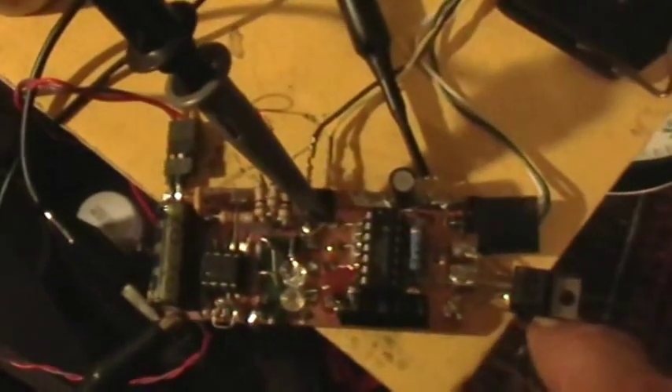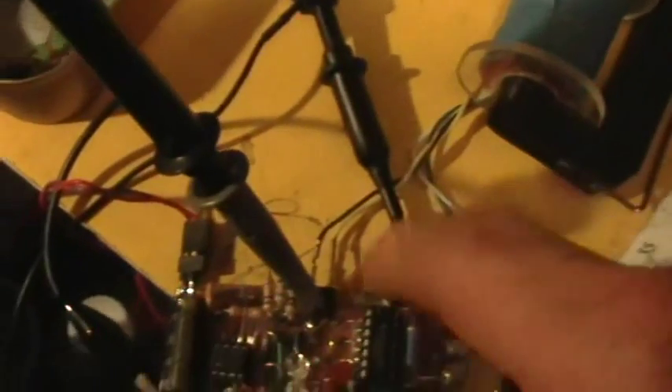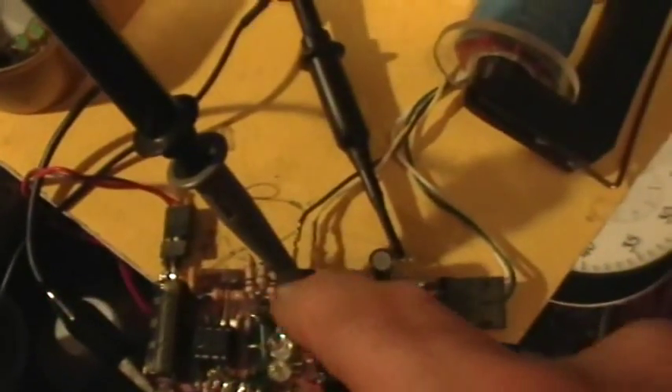This is my build of the Akula 3V Perpetual Flashlight. I've changed the transistor to a BUZ11A MOSFET, and I have the larger inductance on the chip side and the smaller inductance, which is the inner winding, on the inverter MOSFET side.